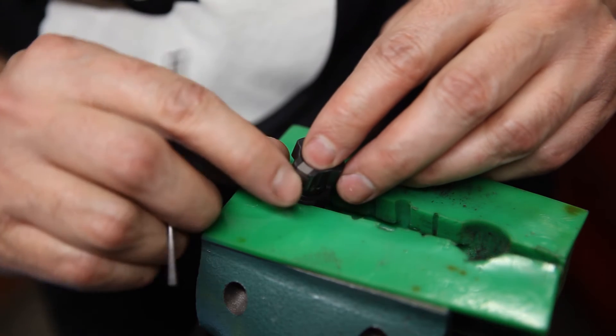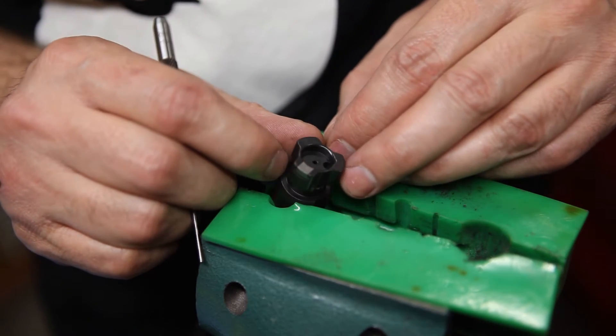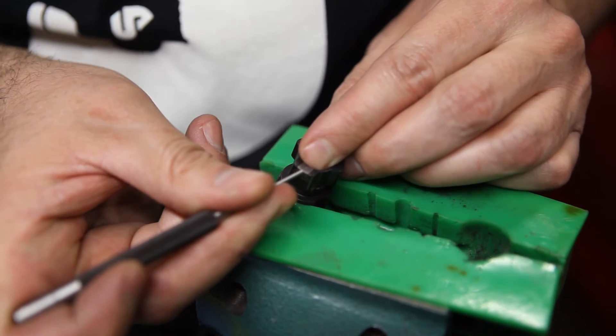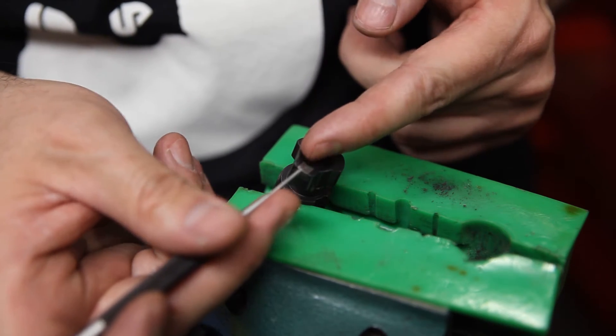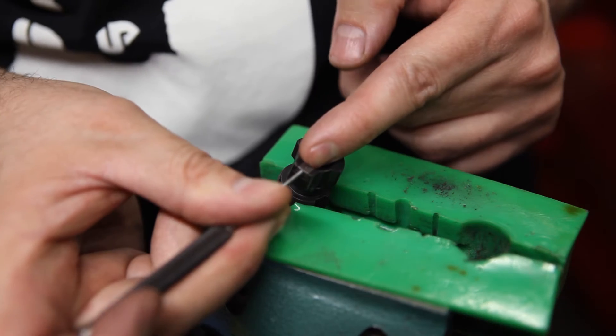You'll see there's a slight rim here — this claw should not be flush with the lug. If it is, you need to push it back in because it means it's kind of bound up. We recommend a little bit of gun oil lubrication underneath this before you put it back on the gun. That's it back in — you can give it a push and make sure it's moving just a little bit. Don't push it without supporting on either side or it will come out again.